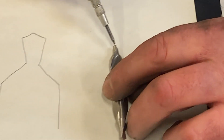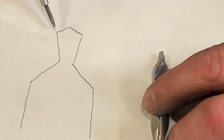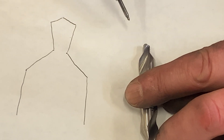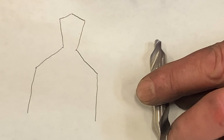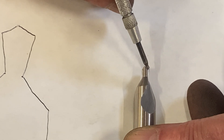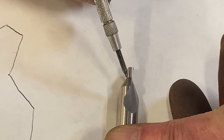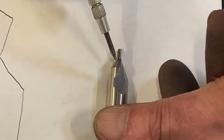I've made a pretty rough, over-exaggerated little sketch to show you the axial relief that's ground into those. It's too faint and too gradual to see by eye, but we can see it with calipers, and we'll also be able to see it with the dial once we get this in the machine. This area also has a radial relief which again we can't see by eye, but we'll easily be able to detect with the dial. This area is a bit more complicated — it has a combination of radial and axial relief, and we'll work through how to determine those once we get it in the machine.